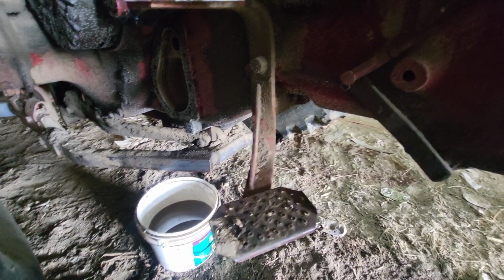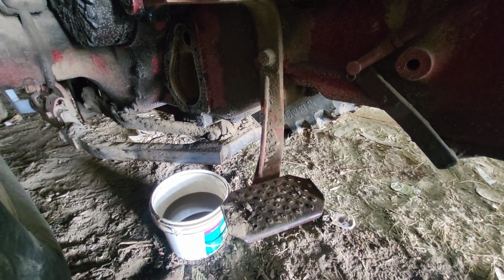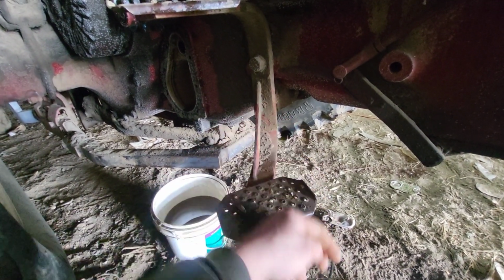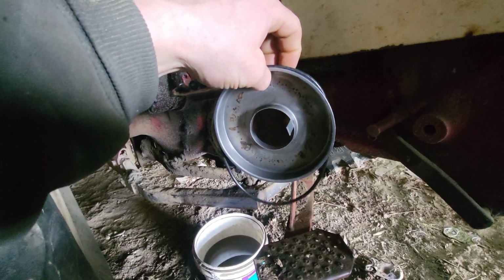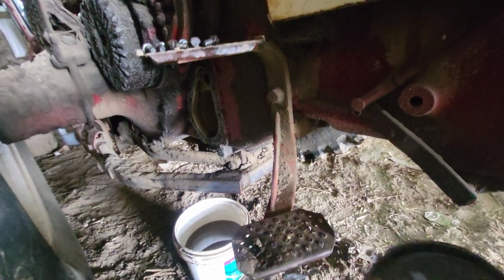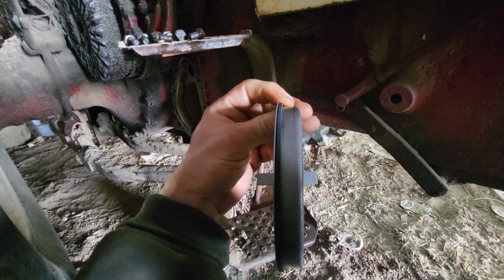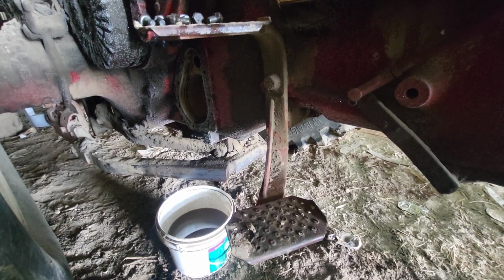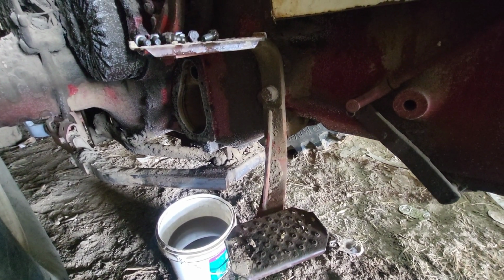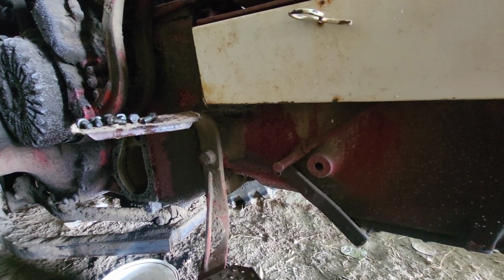So I pulled the filter out, and this goes in the back side of the filter, with a big old O-ring on there. The O-ring basically fell out. That's what he stuffed in there. Seriously. What's supposed to be on there is this little square thing here. So I'm going to put a new filter in again, put her back together and put new Hy-Tran in her and see what we get into today. Looks like a dying cat over there.